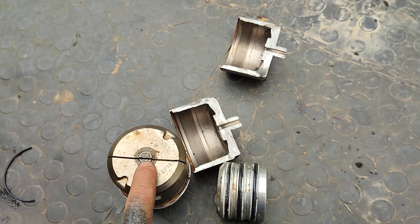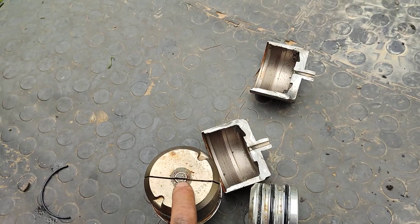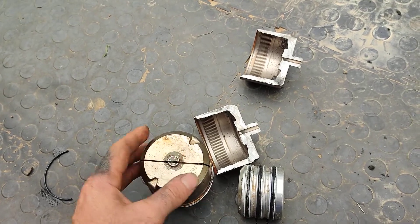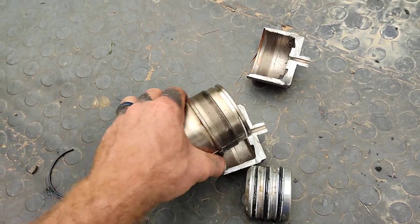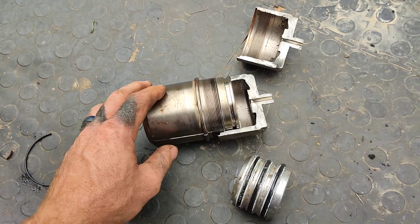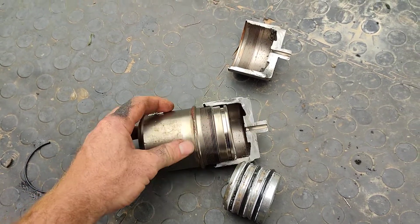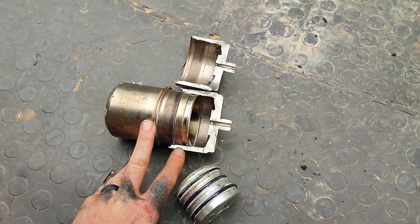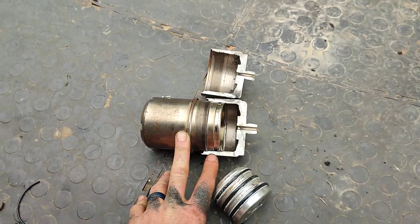You'll then have to get a gas company to repressurize the nitrogen gas in there. I can't remember the exact pressure, but I'll look it up and put it in the description if I find it. Repressurizing the nitrogen should fix the cylinder and it should be a lot cheaper than buying a new one — a new one cost me in South Africa about four thousand Rand, which is about two hundred dollars.